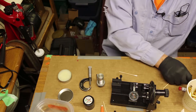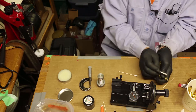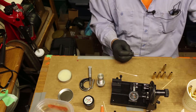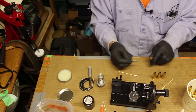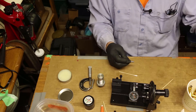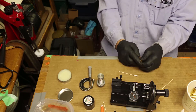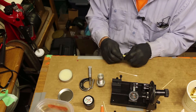Let's check all the other ones I had done. Testing with 262 and 263 mandrels across the batch: several cases accept the 262 mandrel but not the 263, while others accept the 263. So it looks like variations in the neck thickness — the material there — are going to affect tension on the bullet, i.e., case neck tension.